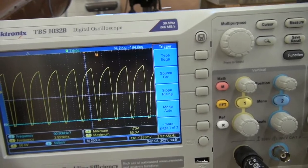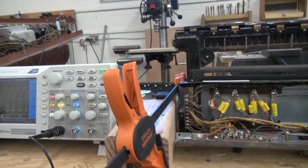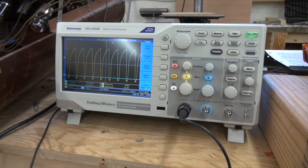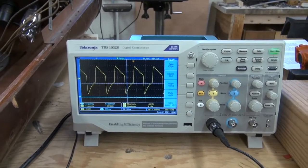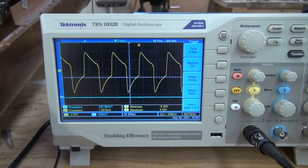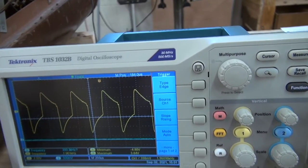C is actually the lowest note of the oscillator. When you play any key, you're switching these capacitors into the tuned circuit. Now I've readjusted the oscilloscope clip leads. Here's where it gets really interesting — that waveform is the output of the binary divider. That is not anything you're going to find with solid-state equipment. I've got it on one of the 6H6 mute tubes, and I can show that when I play B, nothing changes, and then we go down.